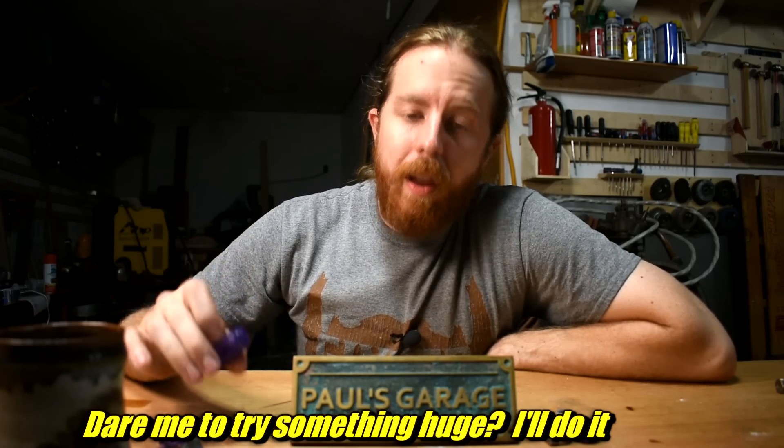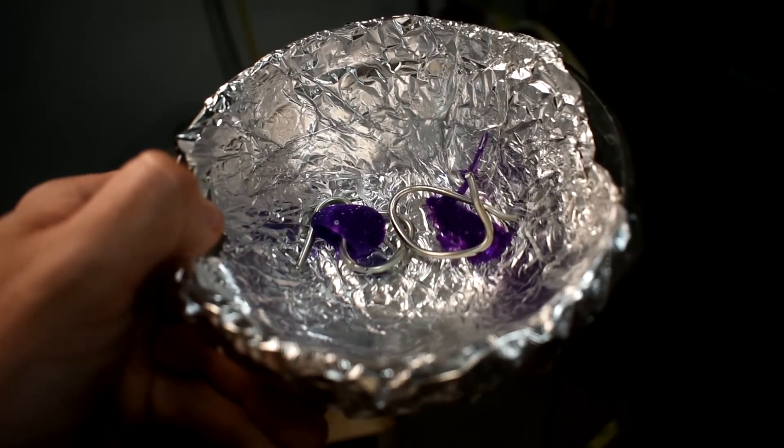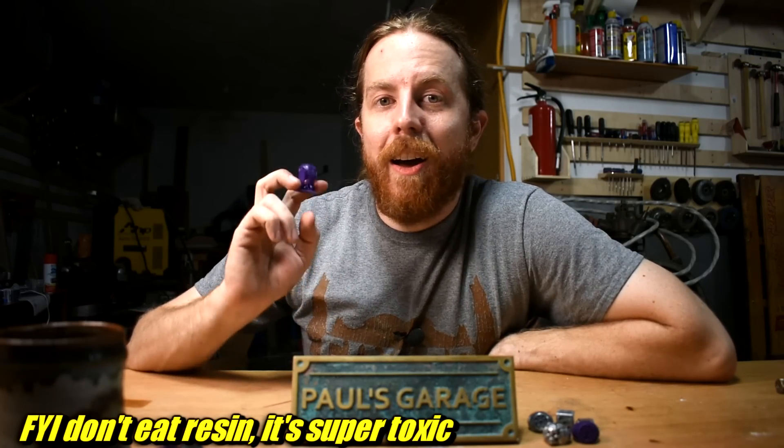It cleans up in alcohol like normal, but the curing process is very not normal. When it's curing, they don't want oxygen to get to it. So following the advice of Vogman - he has a better video specifically on this resin, so go watch that if you're really interested - he said submerge it in vegetable glycerin. It floats in vegetable glycerin, so I strapped a couple chunks of solder on top to sink it, and stuck it in the curing station for a half an hour. Every 10 minutes I went in and flipped it over to get nice even curing on both sides. I had it in a glass bowl with foil underneath to bounce the light up around.